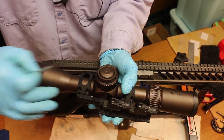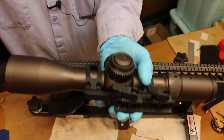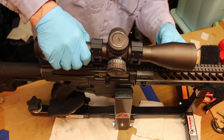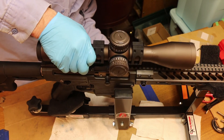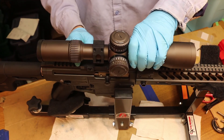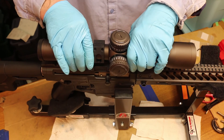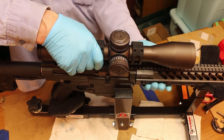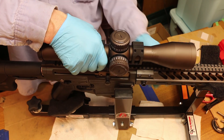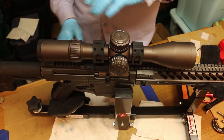In this case it's 206 thousandths on this 20 MOA rail. You could use anything that adds up to the right dimension. To put it back on the rifle, you always want to index it forward. There's a very slight amount of play between the mount and the rail system, so always push it forward before you click your locks closed. Once indexed forward, bring your locks in.